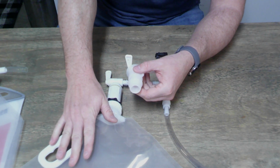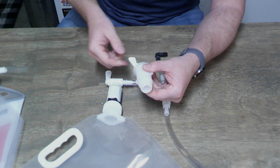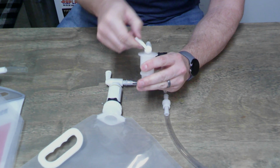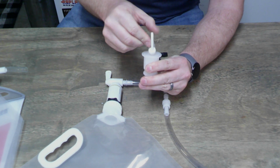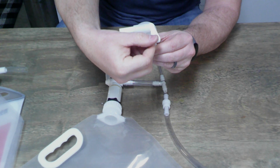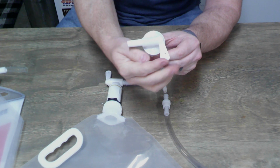As it's full, you can actually shut it back off, and off is completely straight, right? It is not all the way this way, and we're going to explain why, right? So it's up and down like this, not all the way this way. This is open, right? It's this way. And the reason is because there's a little hole right here that will allow a little bit of excess bleeding when that oblong bigger hole on the inside goes over the top of it the opposite direction.